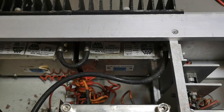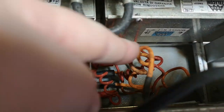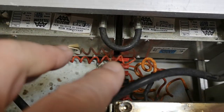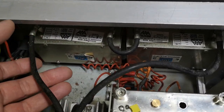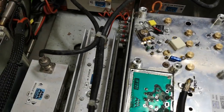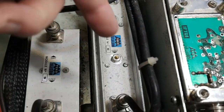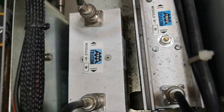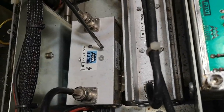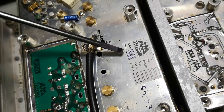The power distribution is done in a quite smart way with mini banana connectors so you can pull out each module individually and do measurements. Everything is on connectors so you can easily check what's working. There are power amplifiers and some big powerful transistors, and the modules are nicely marked with input and output — sometimes even in English.